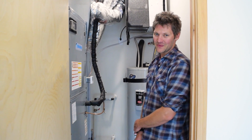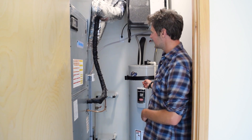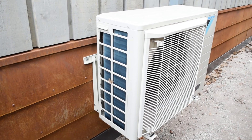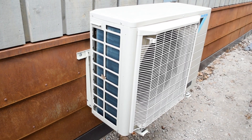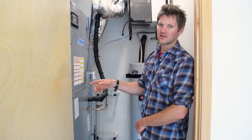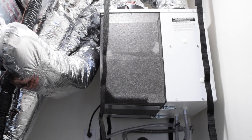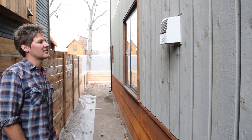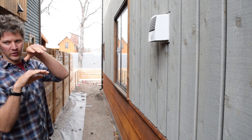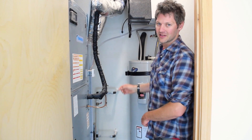This is the mechanical room — it's got the furnace, heat recovery ventilator, and a hot water heater in it. This furnace is what you could call a ducted heat pump. Right outside there's a unit sending refrigerant through and creating warm air. If it gets really cold — maybe 15 below zero — this also has backup electric resistance heat. The HRV, or heat recovery ventilator, brings in fresh air from the exterior and warms it up using the stale air from the inside, so it's constantly circulating fresh air and warming it on the way in. And this is just a standard electric hot water heater.